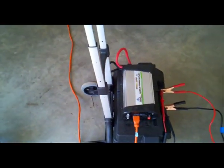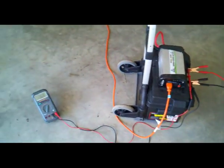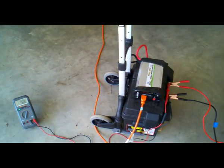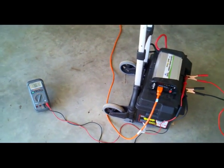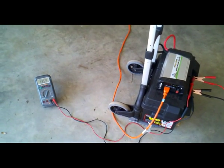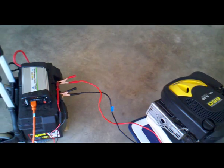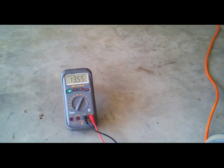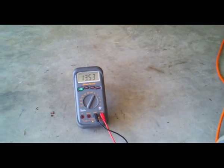Okay YouTube, it shows that this thing will run it — it will run it. What I was running was the freezer and the refrigerator both at the same time, and when you turn them both back on at the same time there's a huge amperage surge that starts up both of those motors. That's why my generator started getting bogged down — it took a little bit to get up enough RPMs so that the motors on the freezer and refrigerator could get up to starting amperage and then run normally.